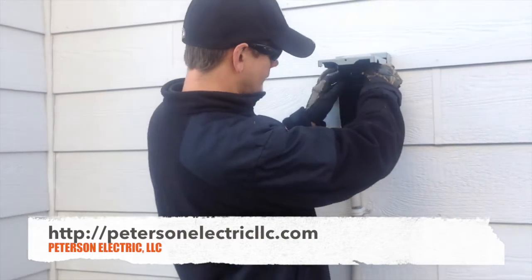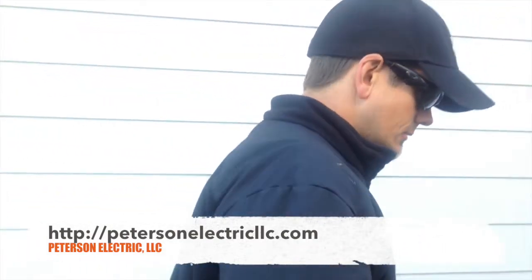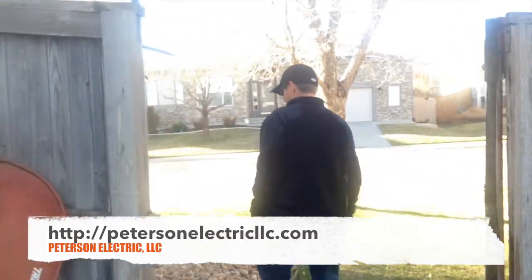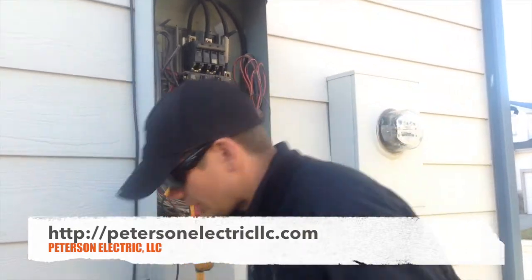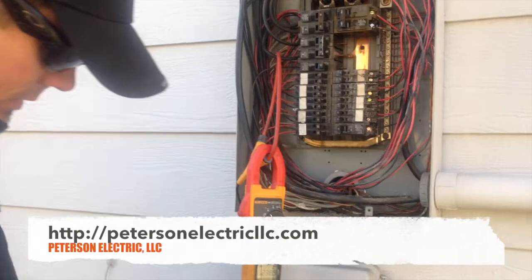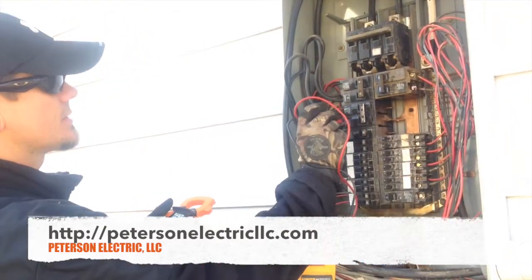Again, trying to determine who to call first is a hard one to figure out. If you have a simple meter and you're not afraid to get in the panel — and I don't suggest this if you're not experienced or licensed — you can simply get in there and read: is this breaker giving me 240 volts? In fact, I'll do that just before I walk out because I popped that new breaker once. I want to make sure I don't have an issue and have to come out a second time when I could have just checked it the first time.